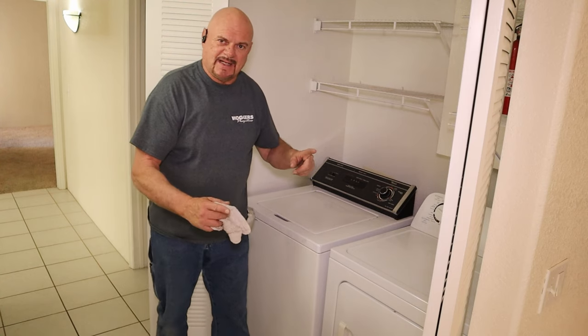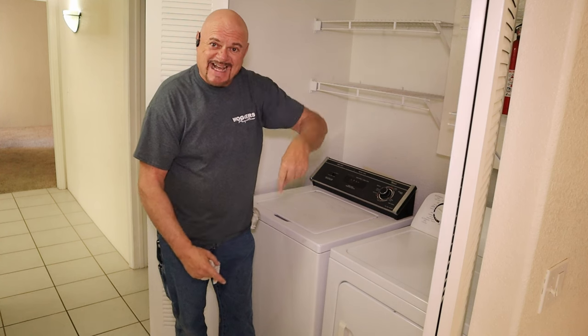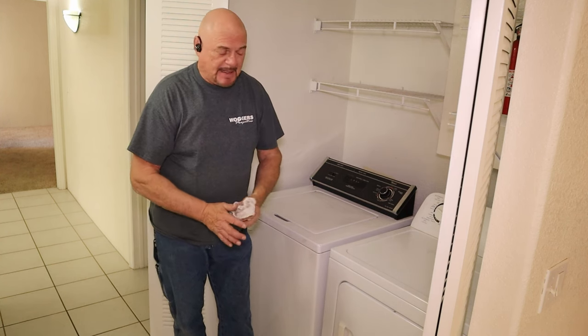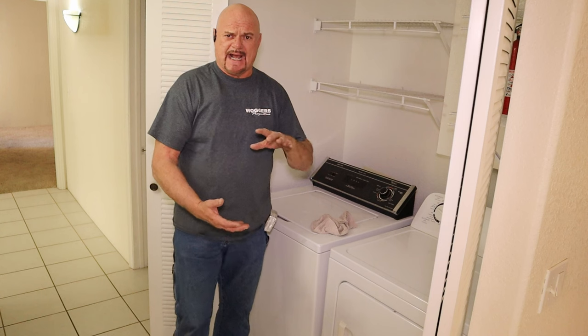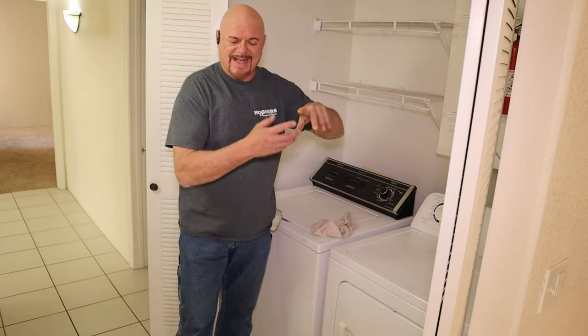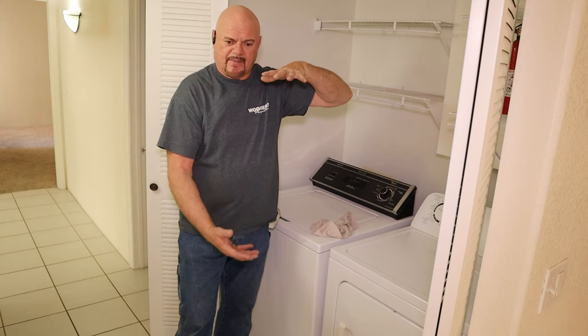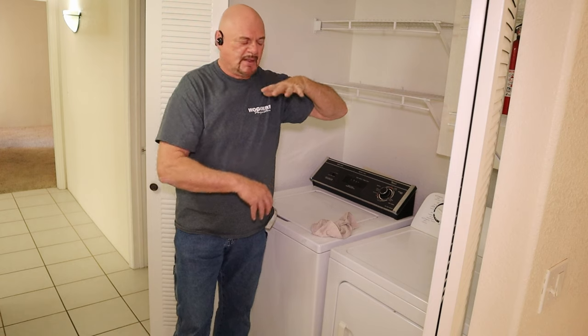This one, they had the drain pipe from the washing machine about 2 feet down the wall tube. You don't want to do that. You need what's called an air gap. In other words, where the water comes out of the tube behind the washing machine and the water that's in the pipe, there needs to be an air gap between that. Otherwise, it could suck water back through.